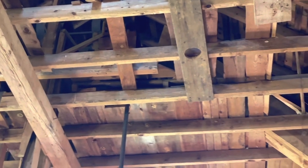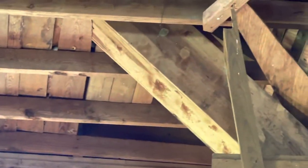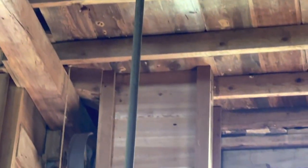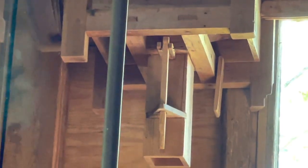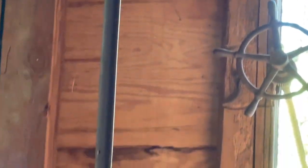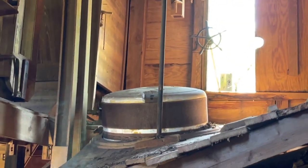The offals from that went out this wooden chute to the outside through the wall. The clean wheat would come down into this garner, and this slide gate latch would send the clean wheat into the hopper above the mill stones.